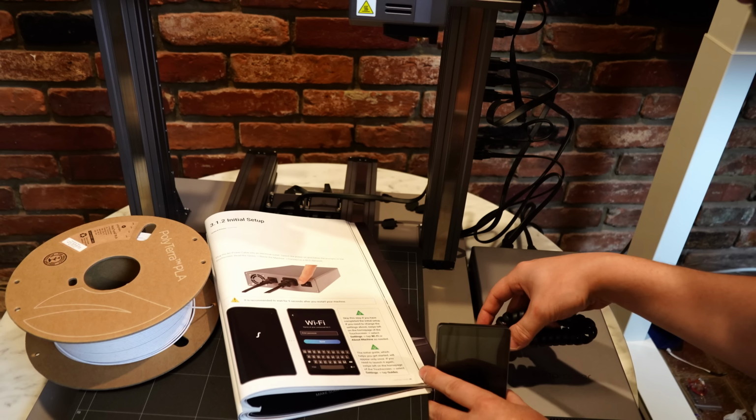While we're printing here, I'm going to see if I can do anything about this fan noise. It sounds like they're not using silent stepper drivers, which is a bit of an oddity in this day and age. It could also be that we've just got so many metal parts that it's not damping the vibrations as well as some of the other budget 3D printers do. Also, it appears to be under extruding a little bit. We might have to do some flow calibration on this machine too.